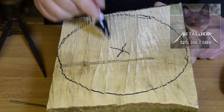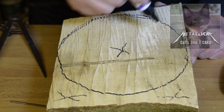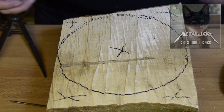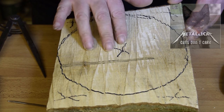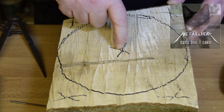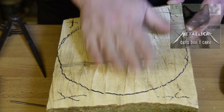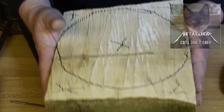And this is the center. So it's just a matter of cutting this away, as it's a waste of time to turn this away, and it's also vibrating a lot. Now you can start drilling a hole for the worm screw, or you mount the faceplate on that one. I'll do it with the faceplate, as this is pretty heavy.